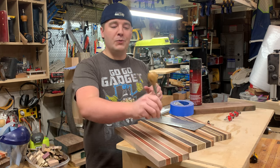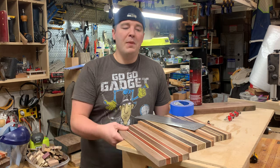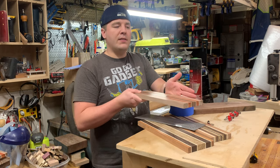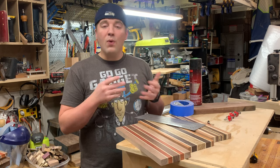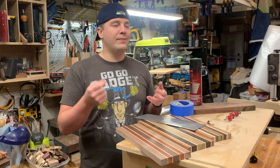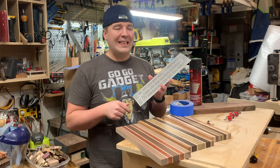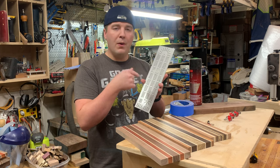Using an awl, punch each hole, then use a brad point bit — make sure you're hitting that point each time. If you're doing the paper route, make sure at your drill press you've got a fence so you're at least consistent on that one side. Rockler makes an acrylic one — with that you're going to need a self-centering bit, sometimes called a Vix bit, to make sure that hole is perfect. I use a steel template; I'll leave a link in the description. It's exactly an eighth inch for each of the holes.